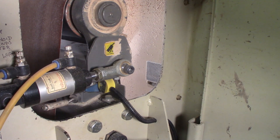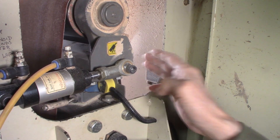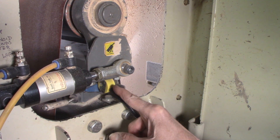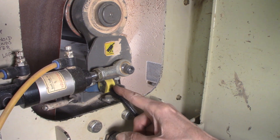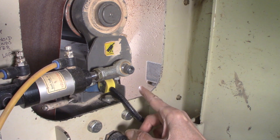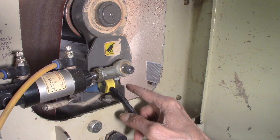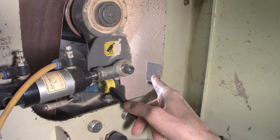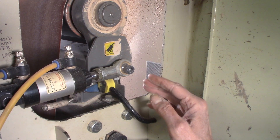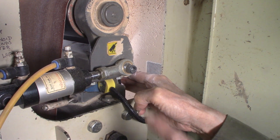One final thing you should all know: how the belt tracks is done pneumatically with an electric eye sensor. They haven't come up with a better way to make it automatically track. Here is the light beam — this is the electric eye right here. The belt can get in front of it and chop that beam, and then this thing says, 'It went dark on me.' When it does that — which I'll simulate with my hand — it shifts this mechanism.